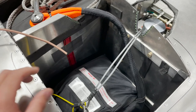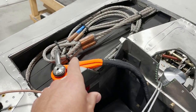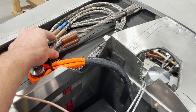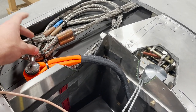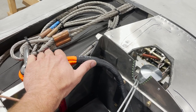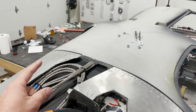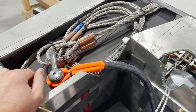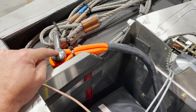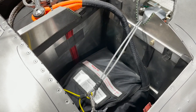The next step is to pull out this cable just enough to reach your canopy cables, then place the D-ring through the strap. The thick right cable goes on top, then the two longer thinner cables go between, and then the left thick cable goes on the bottom of the stack inside the D-ring — that keeps everything square so the four straps come out and line up nicely when the parachute deploys. When you put the pin through the D-ring and thread it in, don't forget to apply Loctite on that pin.